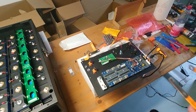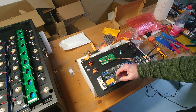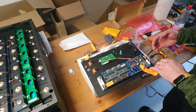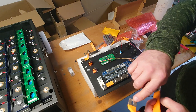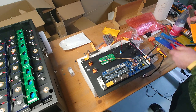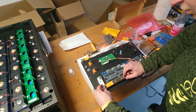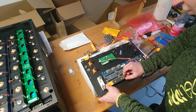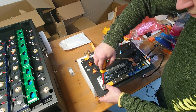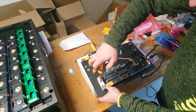Okay, I'm back. So I widened this hole here on the bus bar, which needs to be installed on this position here, and also this hole here to fit the 5 millimeter screw in the right position. And let's see if this is all working like it should be, and therefore I'm positioning it here, and it looks good so far. Yeah, so let's fix the fuse holder first,